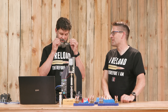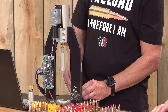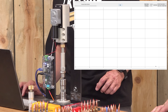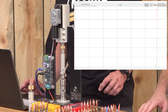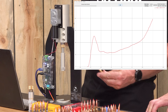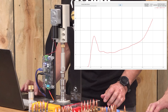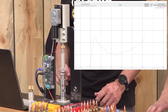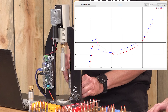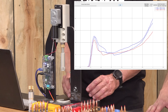So it tells you a lot of information and I'm super curious to see what we're going to find. Let's seat these baseline cartridges. The baseline cartridges are once fired 308 LC brass that has only been full-length sized and mandrel sized with the Wilson mandrel sizer. Here's our first one — looking pretty consistent so far.